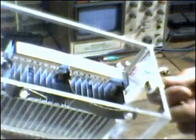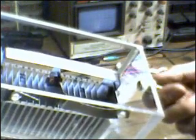I screwed it in about halfway, allowed it to cool, backed it back out, and had some nice threads formed inside the acrylic. I've put some marine adhesive around the threads, put it back in, and I'll let that set — and I'll have a very nice fitting at the top.